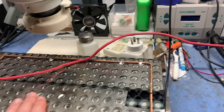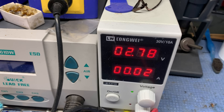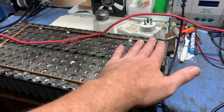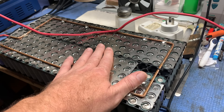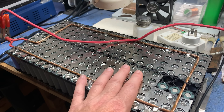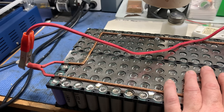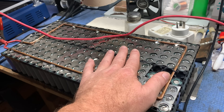A good couple of hours later — it didn't take as long as I thought it would to recover that voltage. We're at 2.78 volts and it's doing 0.02 of an amp charging, so it's doing almost nothing. In that process I was constantly touching it and trying to work out whether I could feel any heat, using the thermal camera to see if there was any thermal problems. Now, one of the problems with the FLIR thermal camera and a reflective surface is it just gives you a false positive, so you've got to hold it at a nice angle to be able to read anything.